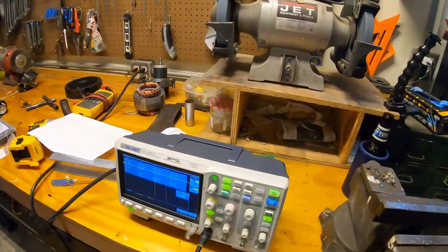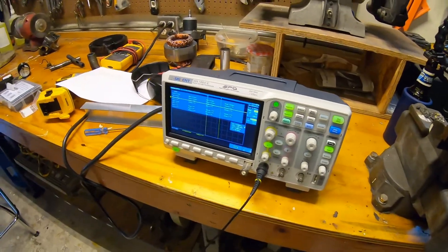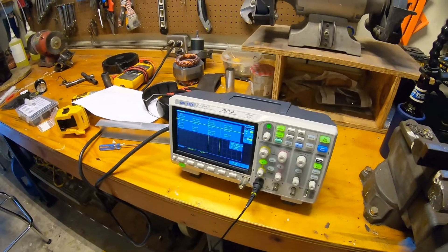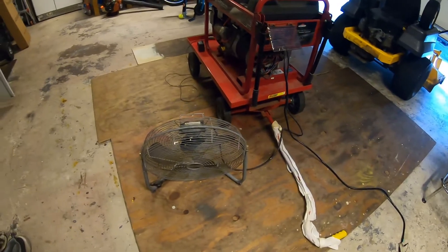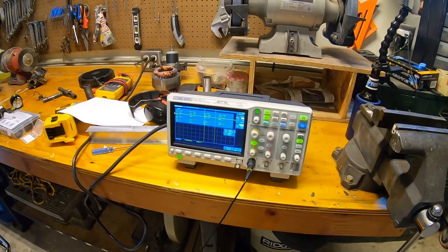So turning that fan off and on, or plugging it in, didn't really seem to affect the waveform. Unfortunately I don't really have heaters or any kind of very linear or resistive load — all I have are nonlinear loads like motors. But that's the best we can do. At least we know that's not a problem with it only unloaded. Granted, a little fan isn't a whole lot of load — it's probably 150 watts out of 8,000 — but it's something. So it's not some kind of unloaded-only problem.